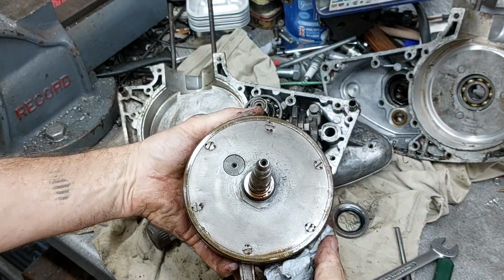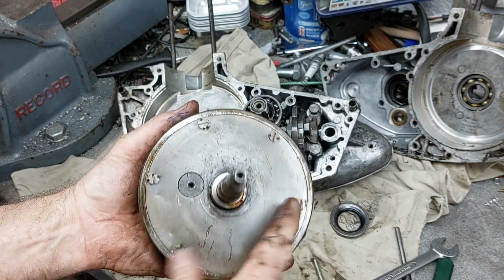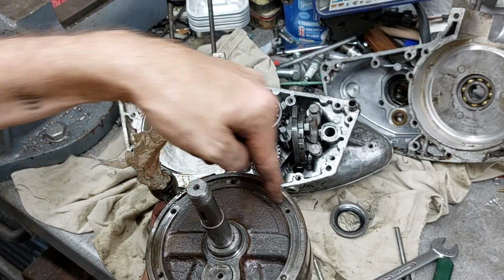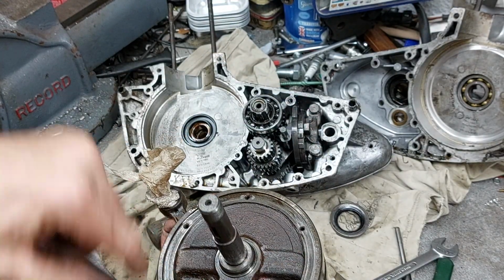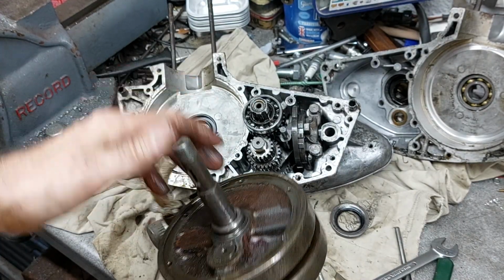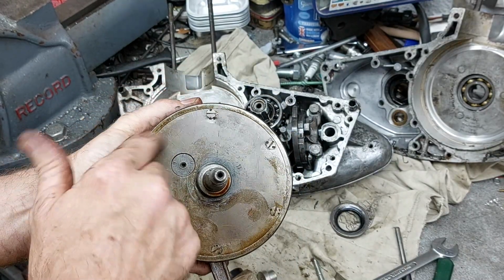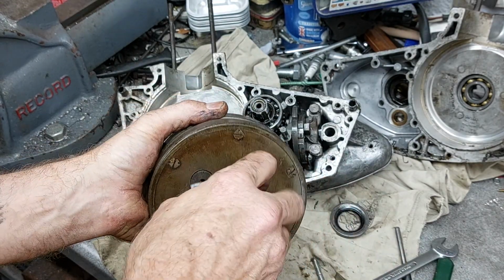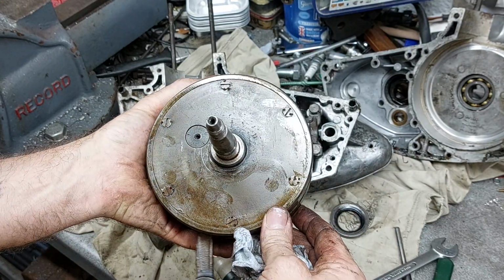And there's the stuffer plate that should be on that side of the crank. So this is missing. I have to make a new stuffer plate to go on there. And I think it might be a combination of Loctite in it, screwing it, and then welding the screws in place so they don't come undone. But if you need to get it undone, they can be ground back and you can take it out.